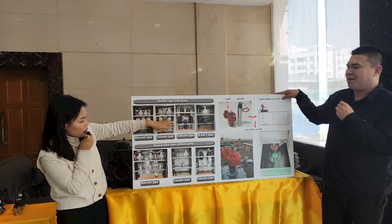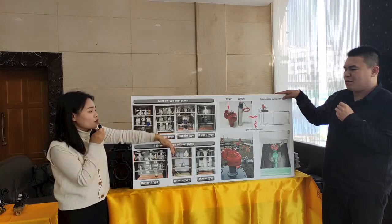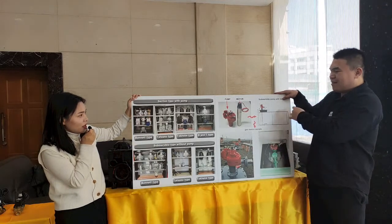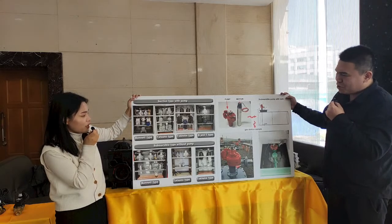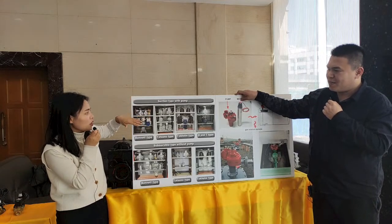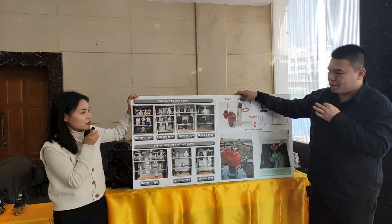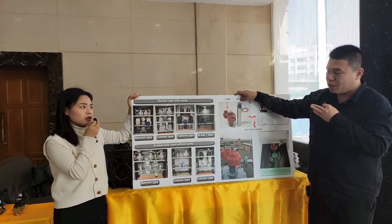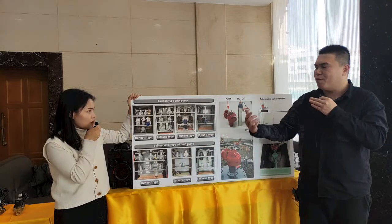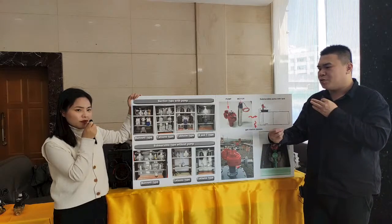But I guess for the submersible type without pump, we need a very professional engineer to maintain, right? Yes, an engineer for maintenance. Suction also needs a professional engineer. But how about the whole cost of suction type with pump and the submersible type without pump? The cost of the submersible type is much lower because the pumps and motors are removed, only the filters. If you have the biggest station, install the submersible type. You save the cost.